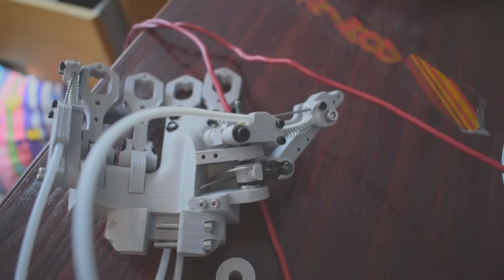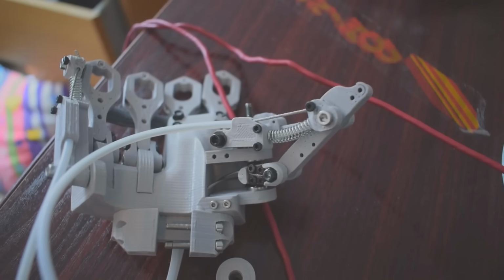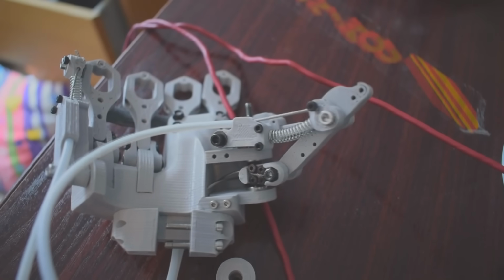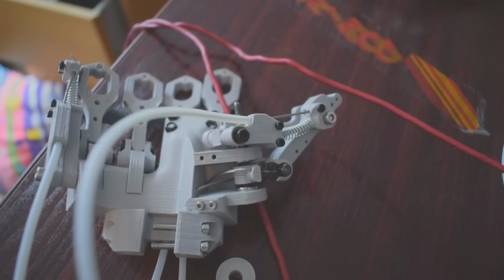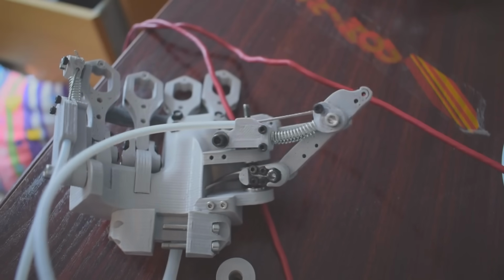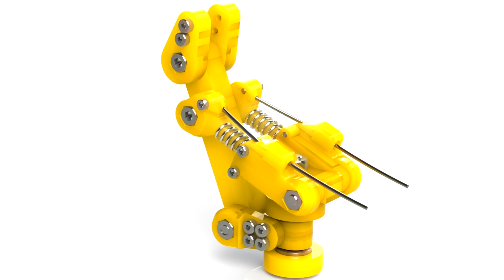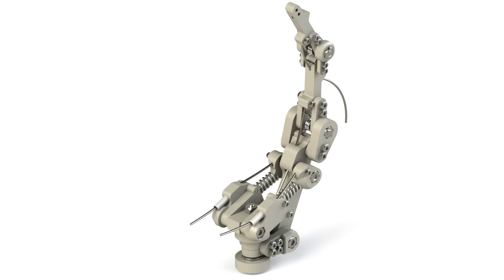So having one axis of motion being the swing around the fingers, from all the way opposing most of the fingers to swinging back and facing the same direction as the fingers, and this uses a little assembly with two little bearings that allows it to swing round, deep groove bearings, so they can have a little bit of force through their axes of rotation, and then a little spring piston assembly to bring the thumb in towards the fingers.